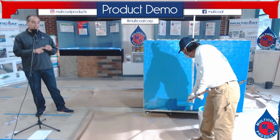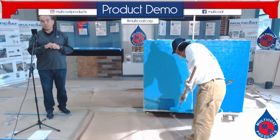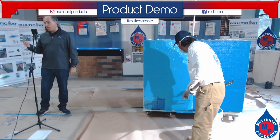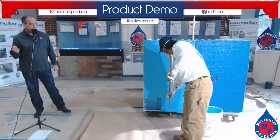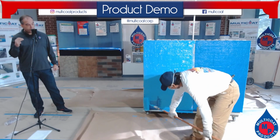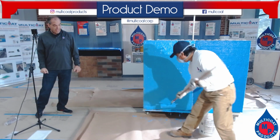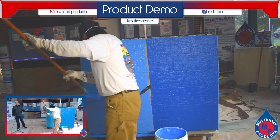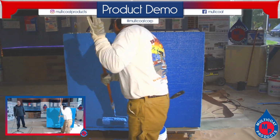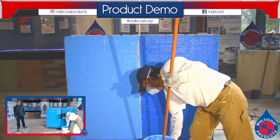Still way superior to anybody selling any below grade product of asphalt emulsion. Neither BG or Multicoat have any UV issues. So if you're in the middle of the project and you need to leave it exposed for some time, there are no UV issues with our product. Again, the perm rate, 0.003 to 0.004. Non-flammable product. I would say most of our competitors are flammable.